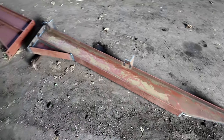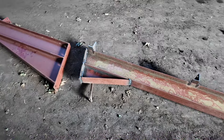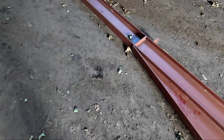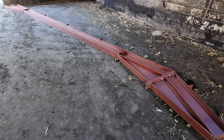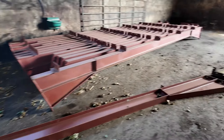I've started making up the overhang to go over the feeding passage. The pillar will go here and then we put the trusses together - measuring the width of the shed. It's 14.3 meters, about 47 foot 6 from the inside of the pillar to the inside of the pillar. Just a couple of bolts in the center and out to there. Getting fairly well along now, just those short overhangs to make for the feeding passage.